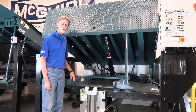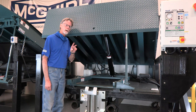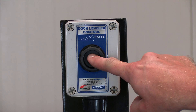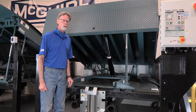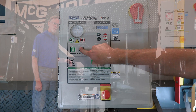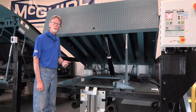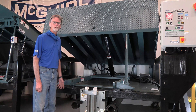After your installation has been completed and the electricians have done their due diligence installing the control boxes, there are a couple of different options. You can do a single push button in a NEMA enclosure. If you want to be more advanced and have a restraint with your leveler or a light communication package, you can do an integrated control system powered by iDOC. There are also several different voltages available for the McGuire hydraulic leveler: 115 single phase, 208 single phase, 230 single phase, 230 3-phase, 208 3-phase, and 460 3-phase — so there's a plethora of different voltages available.